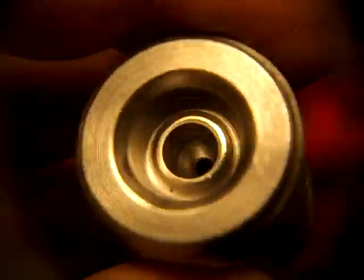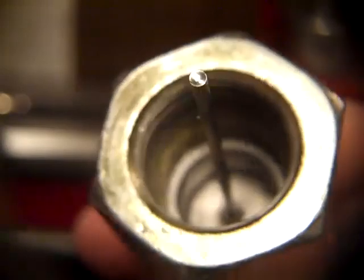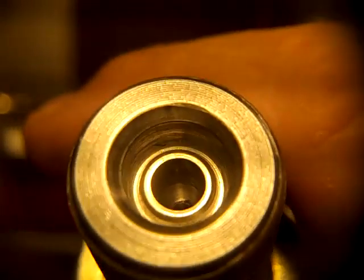Okay, now this is just a thing that's hollowed out, and it's got a stop, obviously. That's a 2mm pin. It goes in there, and this is able to adjust where the very end of it will be. I screw that in until I get the extraction pin right at the end of the bullet, where the bullet nose will be, and it doesn't go out farther, so that creates that stop. And also I have the automatic push button extraction. So that's how that works.